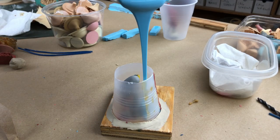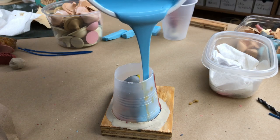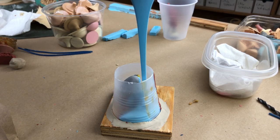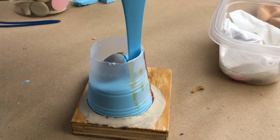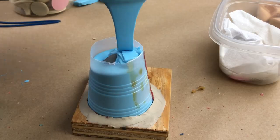We're ready to start pouring. I'm going to pour from the bottom up — and if you've watched my channel, you're sick of me saying pour from the bottom up. But you always pour from the bottom up, so that the rubber will push the air out and you won't trap bubbles. As the rubber rises up in the mold, it pushes the air out in front of it.